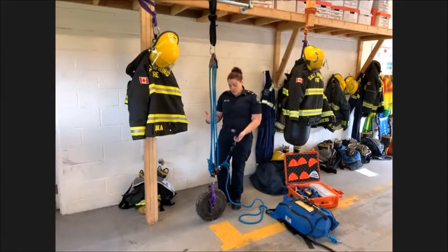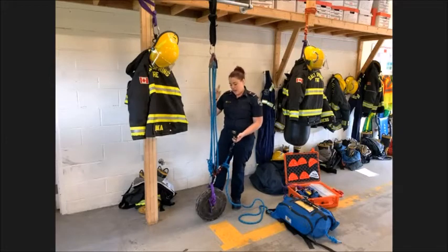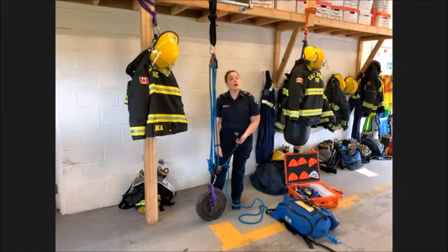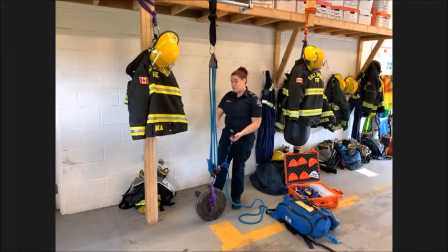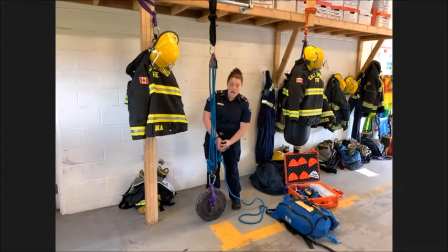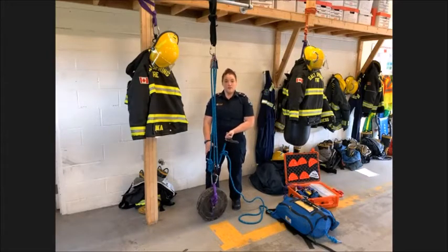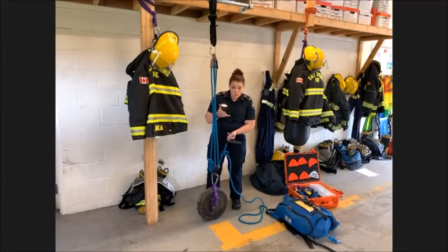We're trying to make things easier. Friction is going to make it a little bit harder. So my rules: if my knot is at my load, it's odd. If my last pulley is at my load, it gets counted as part of my mechanical advantage. And then I count how many ropes I have. In this case, I have 5. That's how we build a 1-to-1, 2-to-1, 3-to-1, 4-to-1, 5-to-1.